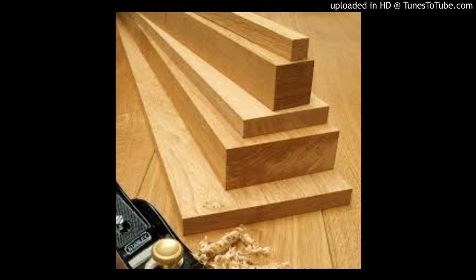Now, even if you're using a 75mm joist, once you get to the very end of it, if you have a screw right at the end, it will split the joist. You can't do anything about it. And that means that that last piece of decking is free to move. And here's a case where it's happened, you'll break a hip with something like that. So the lap joists are for safety.